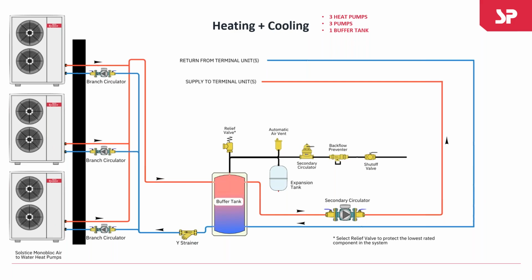Any reputable contracting firm is likely to have a circulator on their truck. Why? Because things just happen from time to time. Notice also in this drawing that the systems are piped reverse return. All right, that's something else that's super important, right? And certainly required to really make sure that we have similar flows across all units.